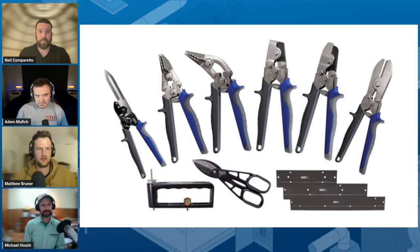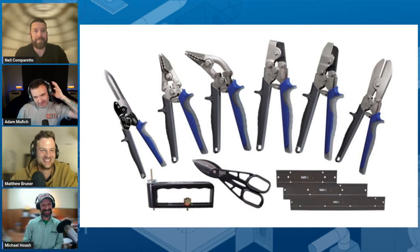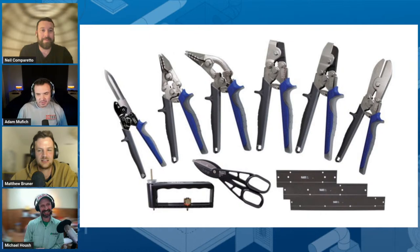Any thoughts on screws versus S-cleats? I do S-cleats and screws, then tape, and if it looks bad we bubble wrap it. I have a portable Pittsburgh machine so all the vertical joints have a seam — it makes a little groove and you just hammer it over. We've had it forever; it's mounted inside our box truck so it's easy to run the metal through to make the edge on it.